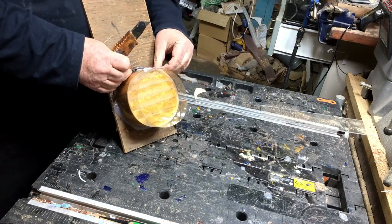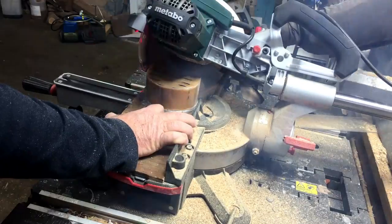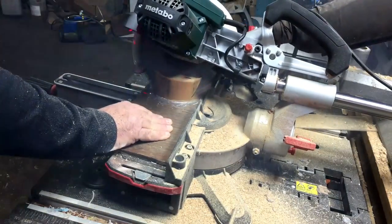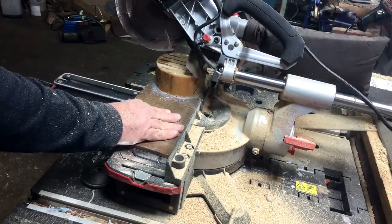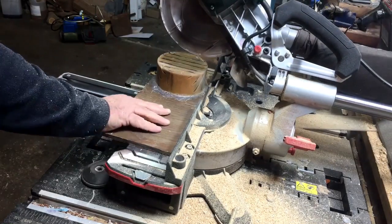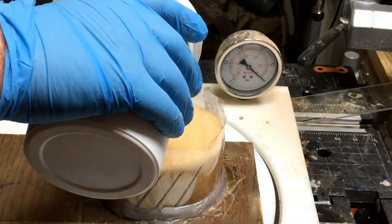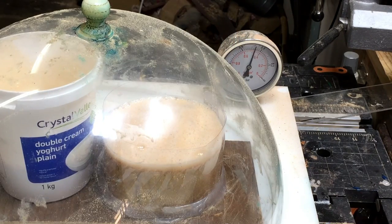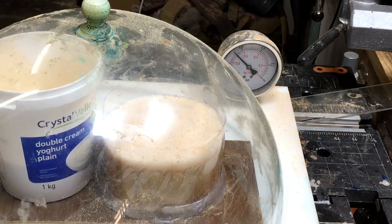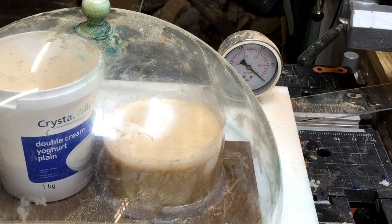Now I'm going to remove the vessel, and you will see just now I'm cutting it exactly the same but in the opposite direction, so I'll have a crisscross of 30 degrees on this yellow wood. You can see here very carefully how I don't cut my fingers, and it goes back into the vacuum chamber. This time I put much more resin on top, and there is resin in a small container — I'm not going to tell you the reason now, you'll see it a little bit later. There is a reason to my madness.